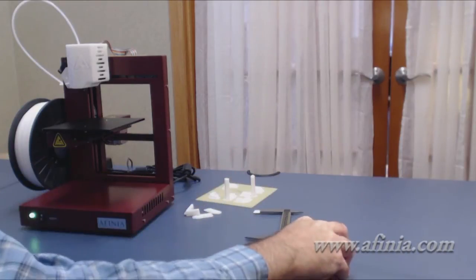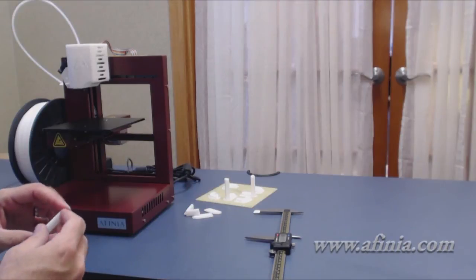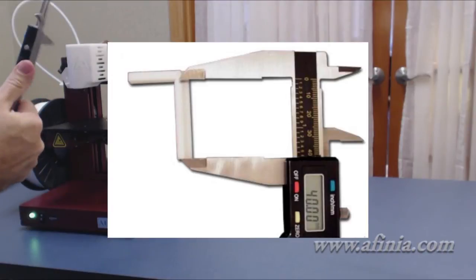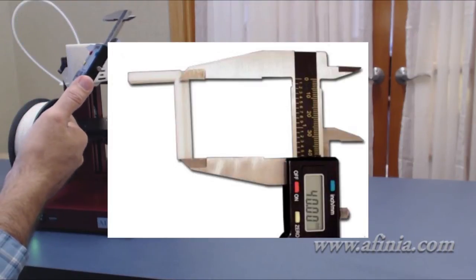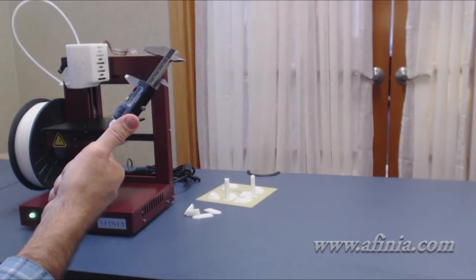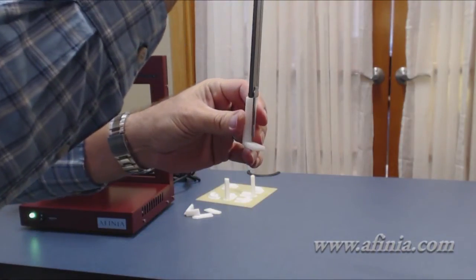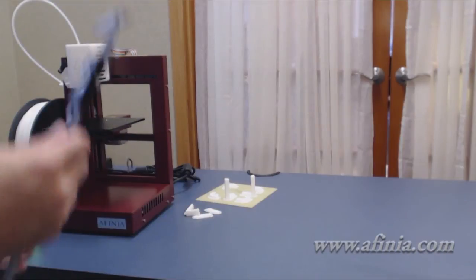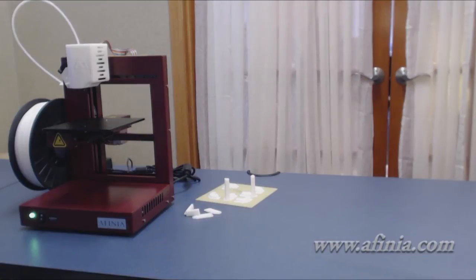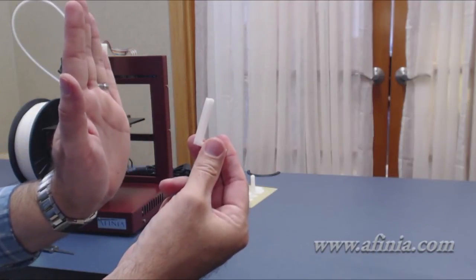I'm going to move this off to the side. Now, with this piece here, we're going to measure the height. The height should be at 40 millimeters. We're going to take and just make sure that from the top down is 40 millimeters — and that's what I've got. We'll document that: this is 40 millimeters. The next thing we need to do is check our angle to see if it's past 90 degrees or before 90 degrees.